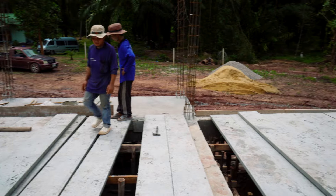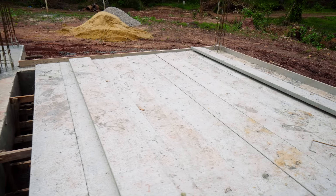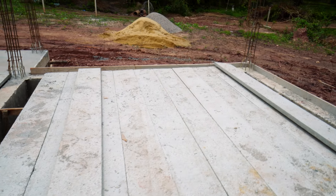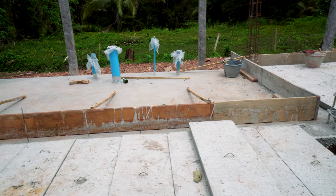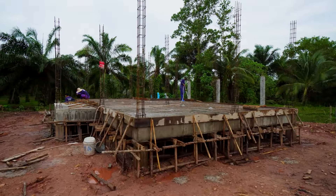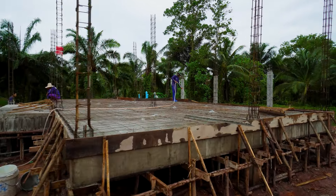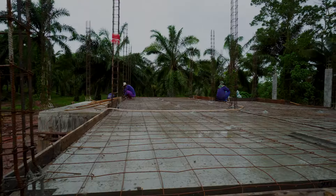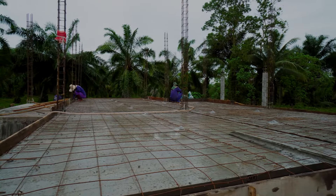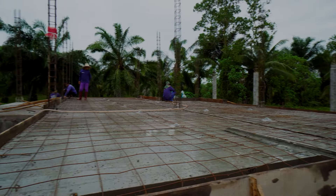Once they get all these planks in, they'll put a wire mesh down on top of this. They're going to pour a topping on it to the top of that perimeter board right there — pour up to the top of that. And then they got a chalk line right there, that's the height they've got to hit. Got her all prepped. They poured some little concrete pads up here so that they know the height they need to be. They'll take this screed right here and the screed will go from point A to point B.